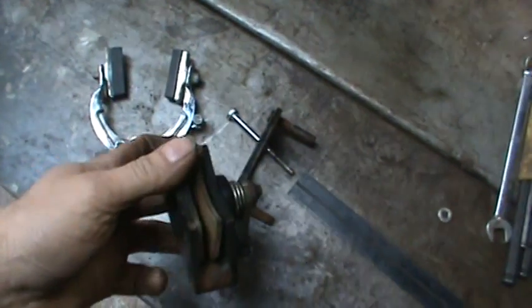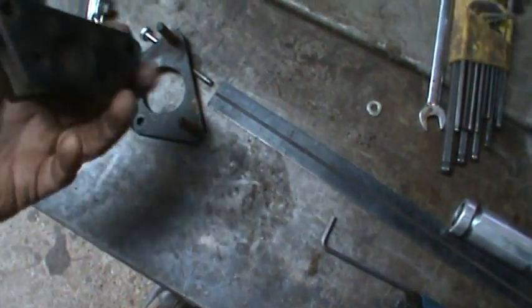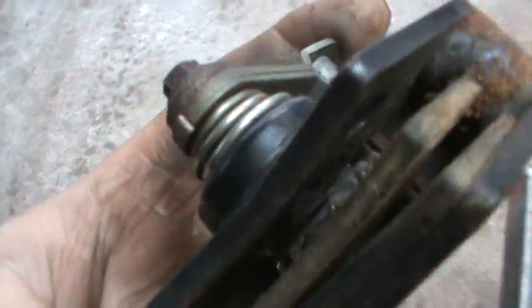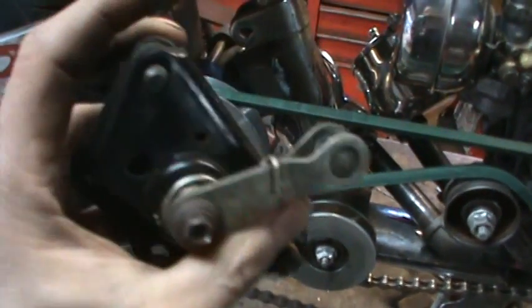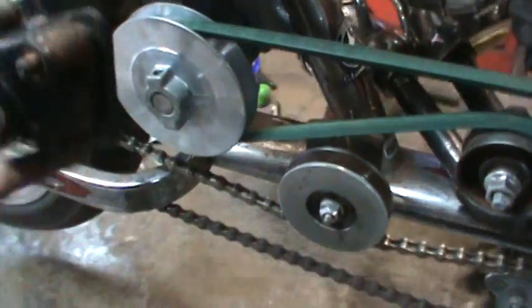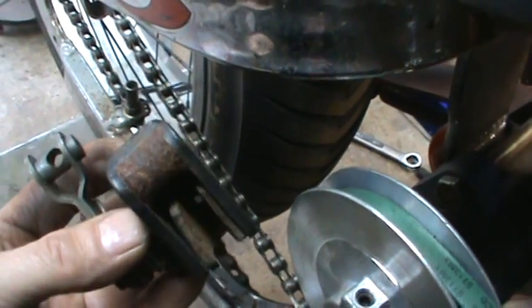I was thinking about going with that setup, but I came across this mechanical brake caliper. You pull that rod through and the inside of it comes out. Brake pads are worn out in it, and it floats on two pins. I may try to get that incorporated onto the disc so it can float on those pins, more like a car caliper. Width-wise is already an issue — it's too skinny — so I'll have to slice it in half and expand it anyway.